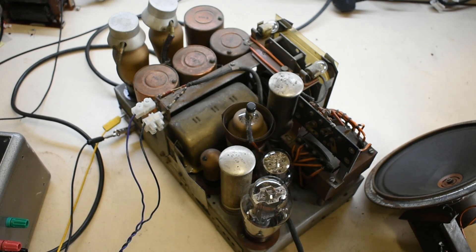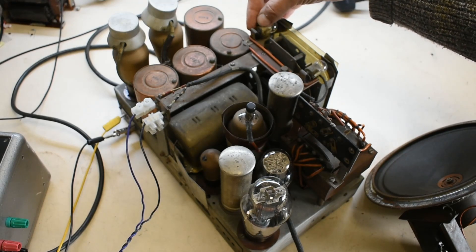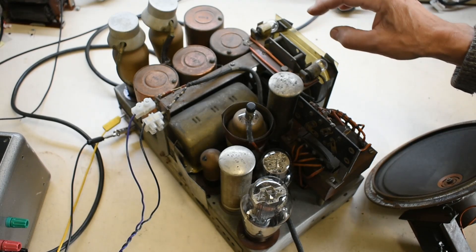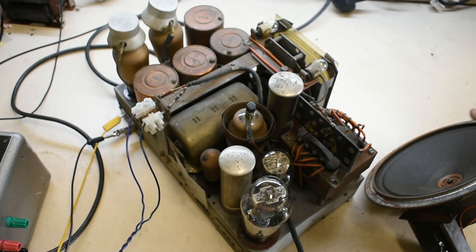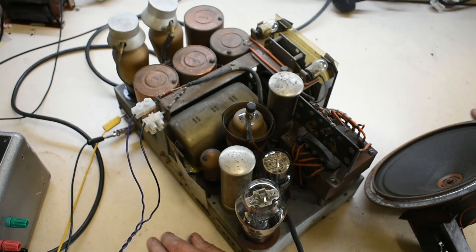Last time I tried this, it was working. It'll be interesting to see. Everybody goes on about the capacitors needing reforming, or in fact you'll probably have to replace them. I think the last time I tried it there was a bit of hum coming through, so the capacitors were starting to maybe go. We'll try it out out of interest.